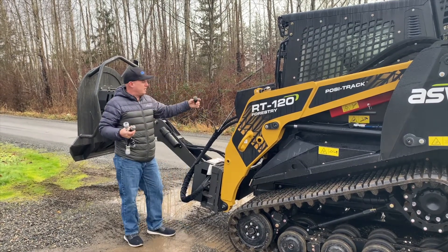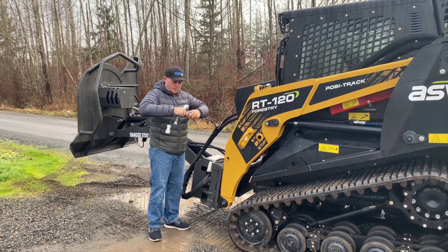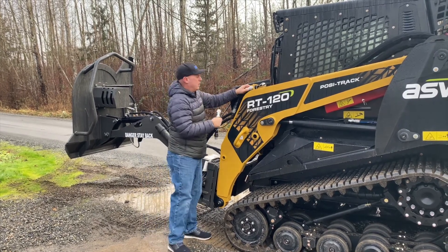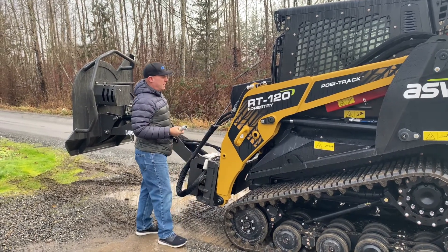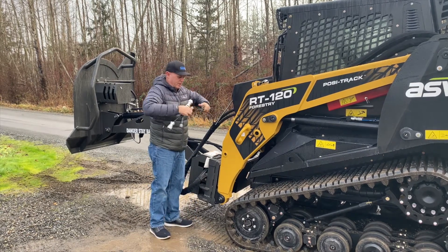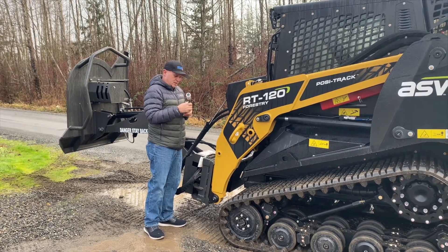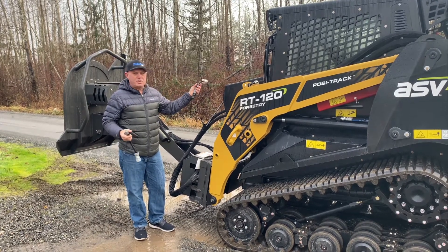CID ships the swing boom with just this connector on here. You plug these in when you want to make them work on a different machine, just by turning it like so, and now I can plug this into the machine. That's to make it work on this ASV, but now if I want to make it work on a 14-pin, I can do the same thing — just turn this until it clicks and then lock the collar in place. Now this will run on that Kubota over there.